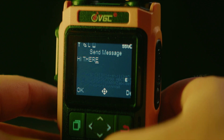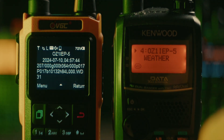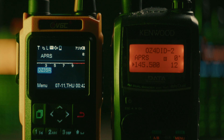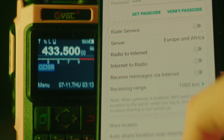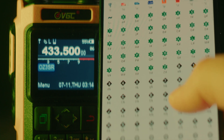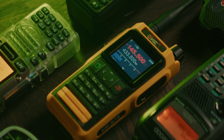Besides these issues, I also have a few more nitpicks. I wish the radio would decode APRS weather stations — it receives them just fine, it's just a matter of converting the weather data into a human-readable format, like on my Kenwood D72. It would also be nice if the most recently decoded APRS station beacon popped up on the main screen. Another nice-to-have feature would be APRS graphical icons on the radio itself, so you could easily identify digipeaters, home stations, vehicles, etc. And it would be nice to have a bigger font for the channel names — but apparently there isn't enough memory on the radio to implement these features. I guess you can't have everything at this price point.